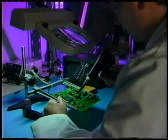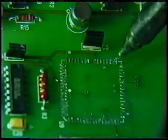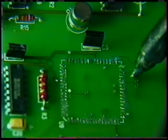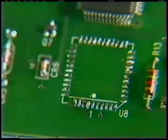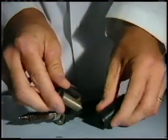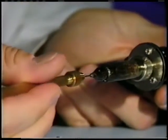Second is desoldering. The desoldering gun is placed on the board until it heats up the solder to a liquid state. You can have major problems if you leave it on too long, like a burned out board or damage to the surrounding chips. If everything works correctly, it sucks up almost all of the solder. Remember, almost isn't good enough. Usually you've got to empty out the reservoir and unclog the tip pretty regularly, and that slows down the process.